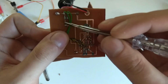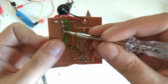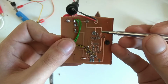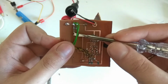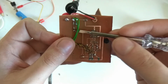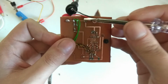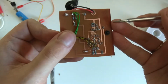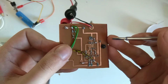This is actually not a resistor, this is just a jumper link. I put that in the prototype so I can disconnect the battery sensing and feed it with an artificial voltage. A generated voltage. All voltage is artificial. No, it's not, but yeah. This is the battery connections here. And this is the filament for the VFD. And that's about it on this board.